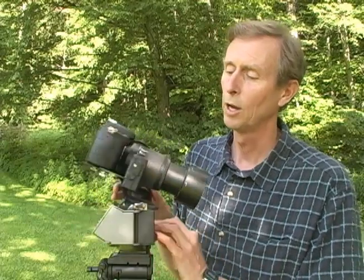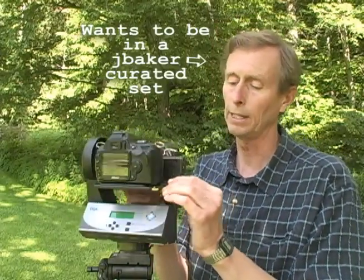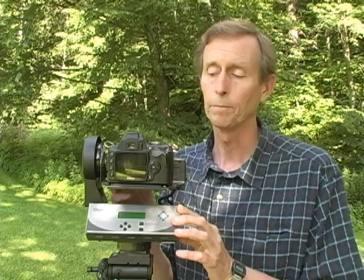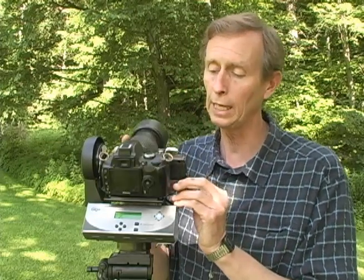The next thing I addressed was the springiness of the camera tray when loaded with a heavy camera and lens. I thought this springiness would prolong vibrations. Rudolf Baumüller shared a solution to this problem on the GigaPan forum. His solution was to support the free end of the camera tray while still allowing it to tilt.